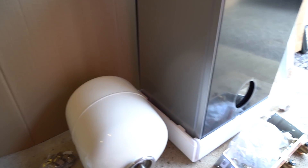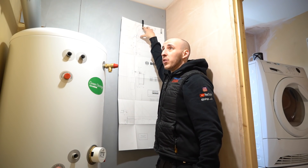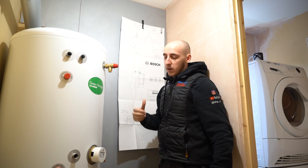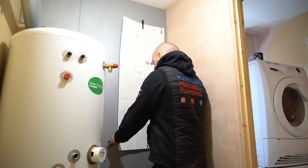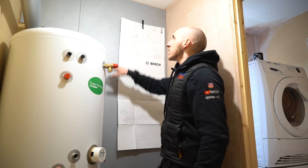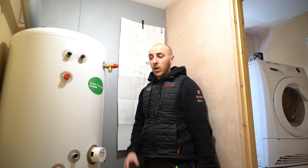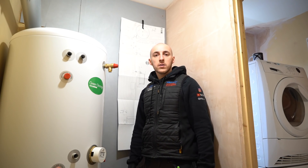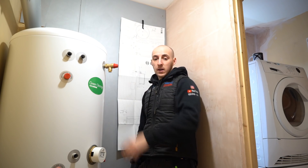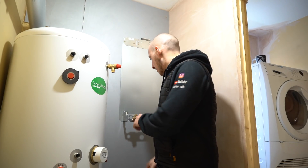I've got some little spray silver paint for some of the waste work. Let's move into the boiler room - got the template on the wall, going to re-drill a new hole for that flue to go through, leaving that one in. There's a window the other side but just checked - 300mm away so that's perfect. Going to send some pipes into the ceiling there, the drops are all behind the camera and in the floor above. When this is all finished I'm just going to have a day swapping over.